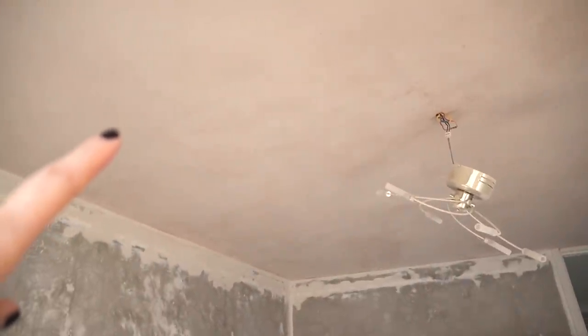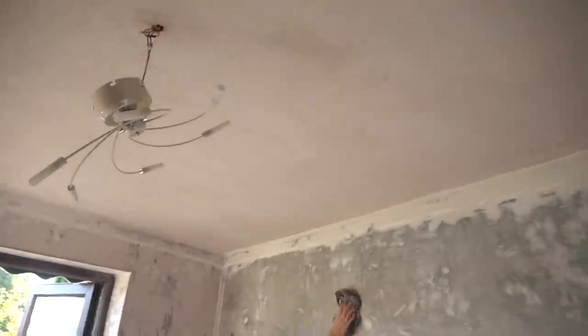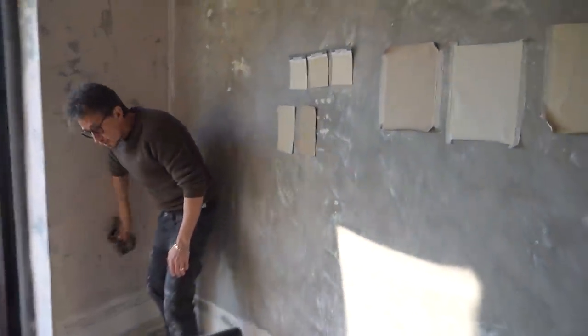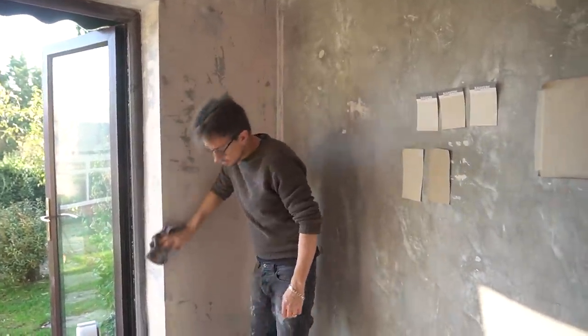Up on the ceiling we need to do a wash of paint, which is basically diluting our base coat with water and then washing it on so that it absorbs into the plaster and doesn't just sit on top. If you put normal paint directly on top of fresh plaster, that will cause peeling when you use tape and other things in the future. So we're doing it the proper way - giving the ceiling a wash - and then the walls we're going to paint in white as a base coat.